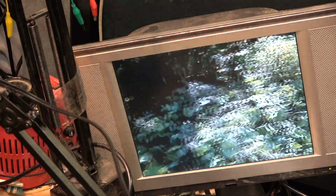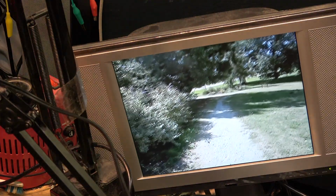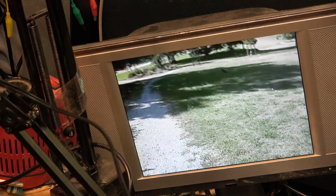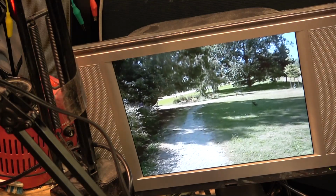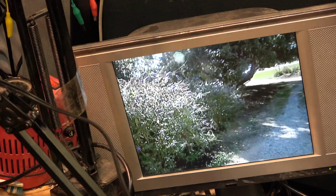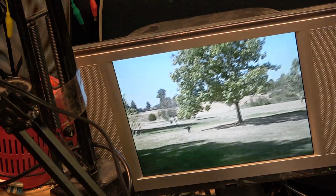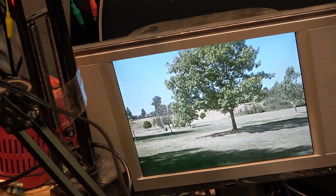One thing I noticed about a camera like this is the sheer weight of it. This is not light. Now I've got a battery belt or a battery pack on my other shoulder. This is what I'm using for a battery. I've just got a gel cell. You know, those little fanny packs, and I just throw it over my shoulder. I use this with my other rig as well, because it lasts a lot longer than using the NiCad packs. It also kind of balances you when you've got a weight on the other shoulder that's almost as heavy as the camera. It tends to level things off a bit.